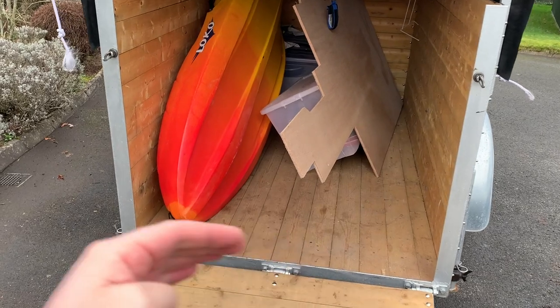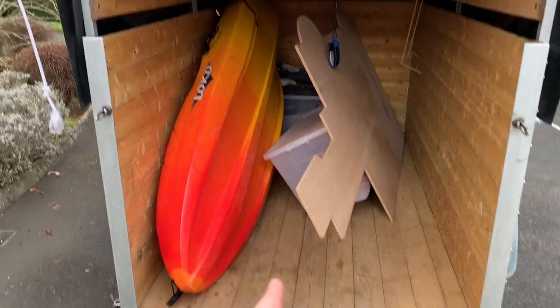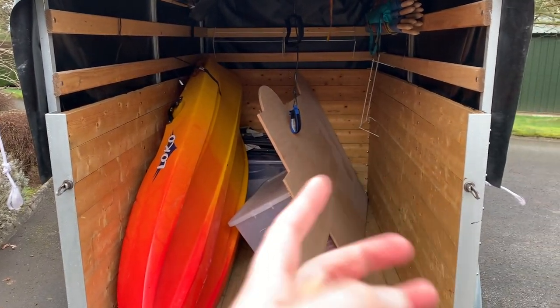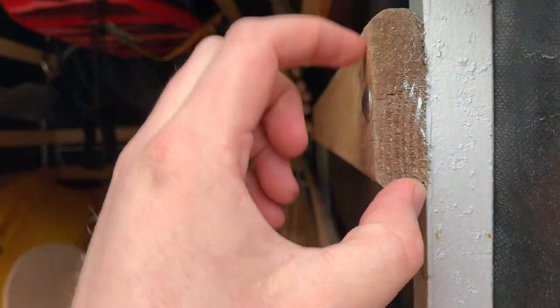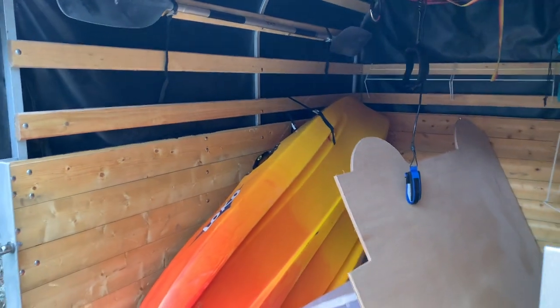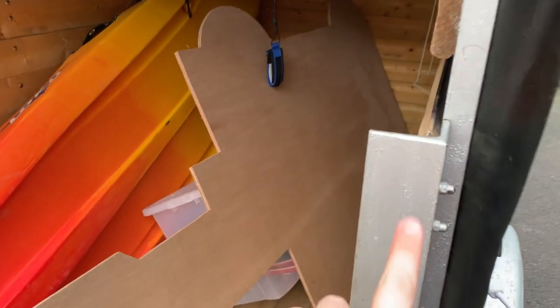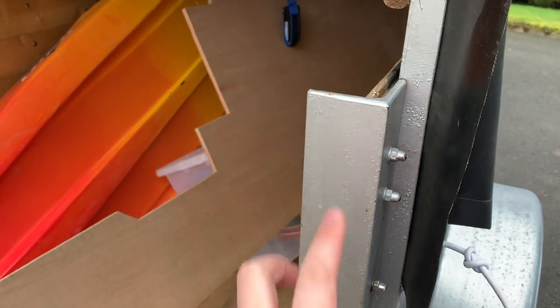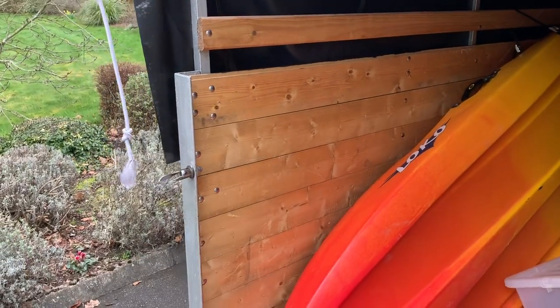All the wood has been replaced, mainly because it was full of woodworm and rotten. It has a double floor for strength — the underfloor slats go transverse and on top they go longitudinal. These are garden landscaping grade, all treated and machined, with a nice rounded profile. All the fittings throughout are stainless steel, so a lot of work went into this. I've replaced them all with dome nuts just for tidiness — again all stainless — and all the coach bolts that hold the wood to the metal frame are stainless as well.